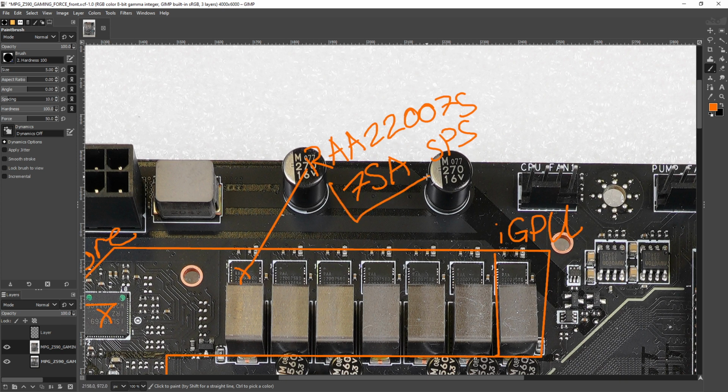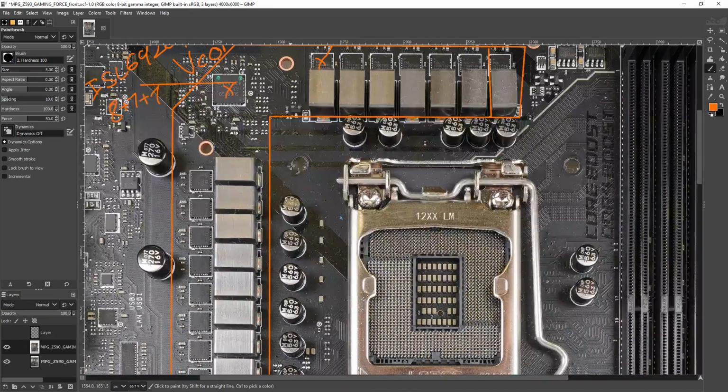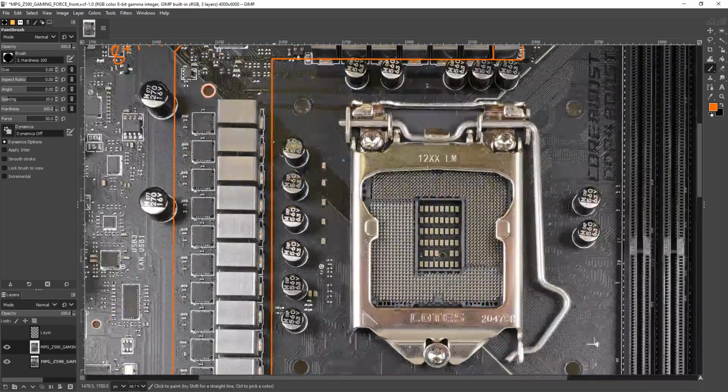The other thing is 75 amp smart power stages. This is a super weird current rating, right? We've got 70 amp parts, 80 amp parts, and it's like, do you really need a 5 amp step between the 70 amp parts and the 80 amp parts? Apparently we do. Either way, these have very similar performance to all the other 70 to 90 amp smart power stages that you see from most manufacturers. So all that really means is that with 16 of them making up the V-Core VRM, this motherboard is really, really powerful.